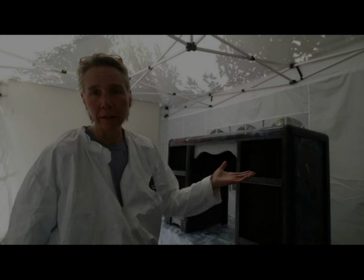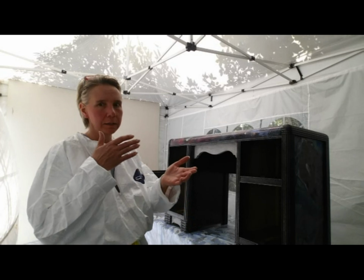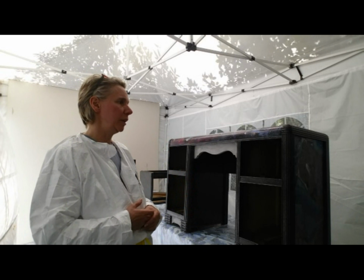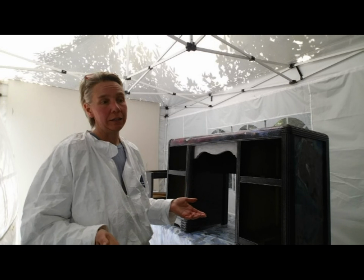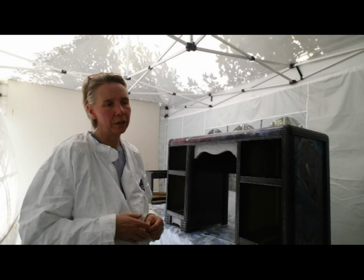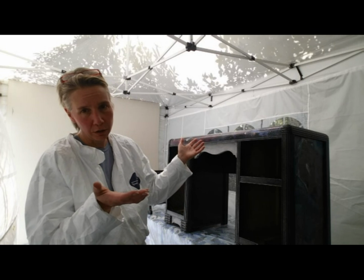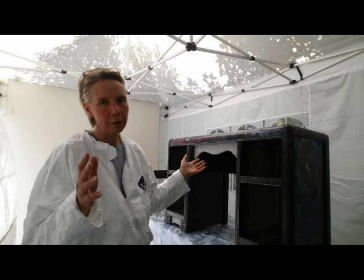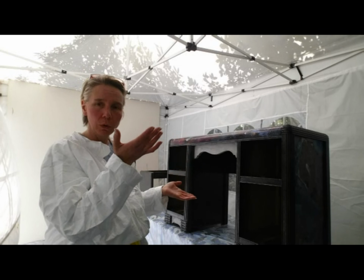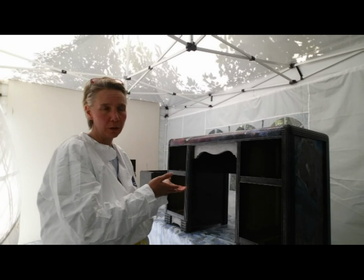How do you know when the next coat should be done? You can't necessarily look at the clock and go, okay, exactly 20 minutes. It has a lot to do with environmental factors, humidity, and most importantly, heat. Today we're running at the high end of the range, which is no colder than 50 and not really any higher than 80, although I've pushed it to 85 and gotten away with it. At 50, you've got a longer dry time, so more time between coats.